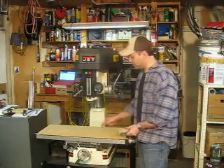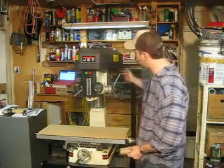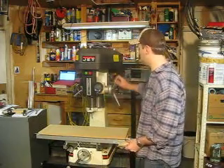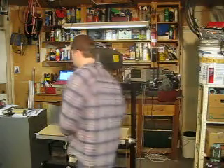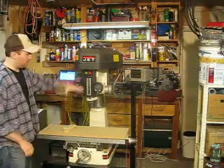What we actually need to route through is this base plate itself. This whole head needs to move down, or else I won't have enough travel on my quill — it won't even reach all the way down there. My cutter won't reach. So I need to go ahead and move this down.